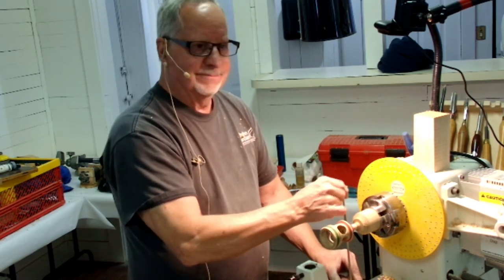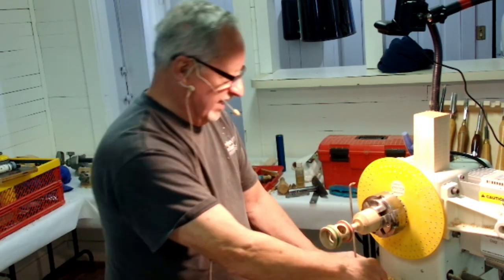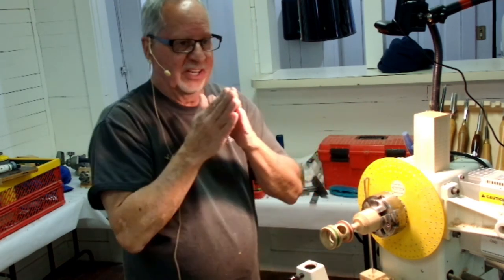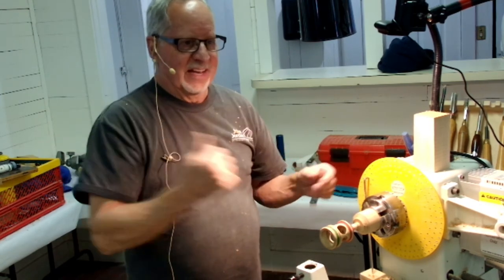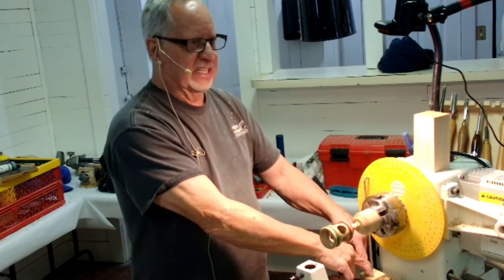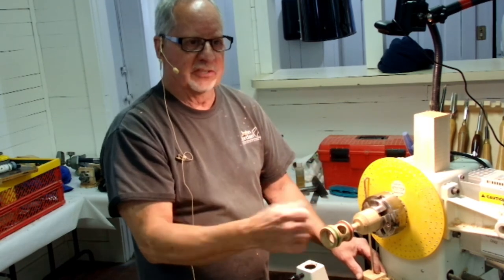it's spring-loaded. It's just a 3/16 piece of steel rod. I bent it 90 degrees. I sharpened the end to a point. What I did first was sharpen it to a point using my drill on my grinder, and then I took my torch, heated it up, and bent it 90 degrees. Then I glued it in a 3/16 hole with CA glue, and when it got dry, I took my pliers and twisted it 90 degrees.